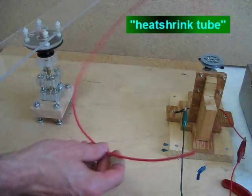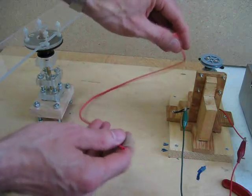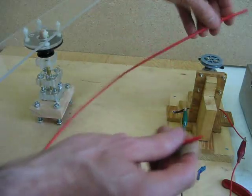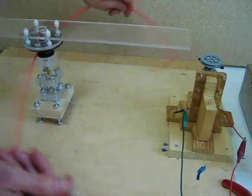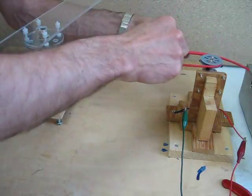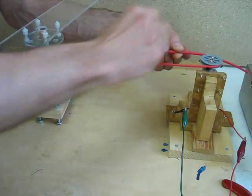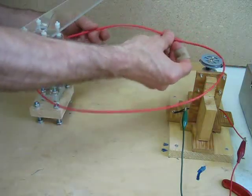What I thought I'd try is this — it's heat shrink tubing. You find it in electrical stores, and it's normally used for adding to bare wire in order to insulate the wire electrically, or to add insulation to existing insulated wire. I figured it might work for these purposes. All I need to do is somehow connect two ends together. What I figured I'd try is to fold one end and push it inside the other end, and then heat it — hopefully that'd make a good joint. I actually did try it with a long length like this, and that actually did make a good joint.